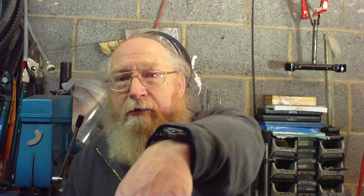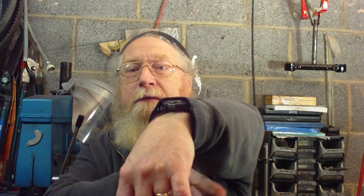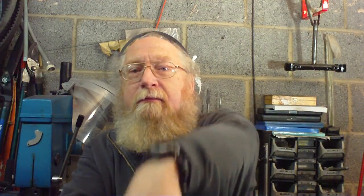It's always worth remembering that rotating machinery bites. It's not going to give in, your body's going to give in. The body is quite a squishy thing, and a lathe is a big lump of metal, some of which is rotating quite fast, quite powerfully, and it won't hesitate to rip your arm off and beat you around the head with a soggy end. So always be careful. Never reach across a spinning chuck for obvious reasons. Once again, if you're reaching across, the chuck is spinning, catches your sleeve, down you go.